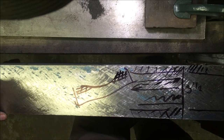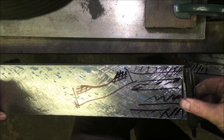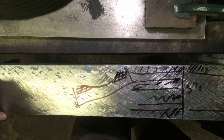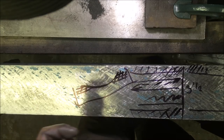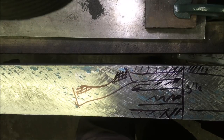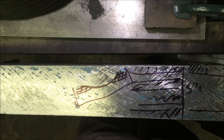What I can't afford is for it to be twisted as it goes down its length. That really will be a pain in the rear. Not a scenario we ran into on the others. I think when this straight edge was originally scraped, I suspect it's been done with a narrower 6-foot straight edge, and that's what's created the problem.